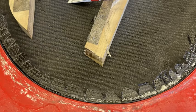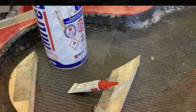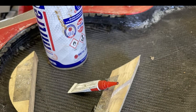Here you can see the pieces placed in the mold, and this is the purfling in place. Be sure you sand all this purfling so that you get good contact with the epoxy. This shows the notched areas — they come together quite well. In the upper right corner there's an inside curve, and that's where I use the straights. The point here is to lay this so that it's absolutely flat with the inside of your mold, because when you put the molds together you're going to want that to fit.